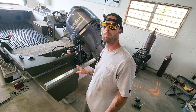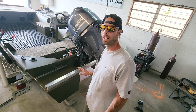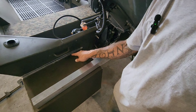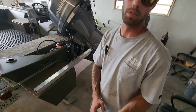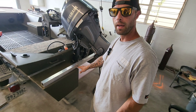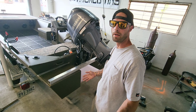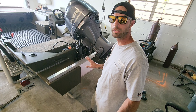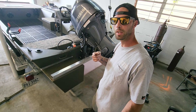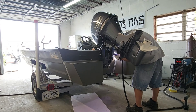I've got both of these pods tacked up here, and it's going to be a pain to weld. The back of the transom warps a little bit from the factory welds, and I've got some pretty good gaps in here — there's a decent-sized gap right here. I'll try to pull some of that out if I can, but I can only do so much. They are pretty flush across the top, and they actually look even better across the bottom with a straight edge. I figure it's better to have the bottom flush since that's where it'll cause drag and ride on top of the water. I'm going to get this thing welded up — putting you guys back on the time-lapse. Let's get back to work.